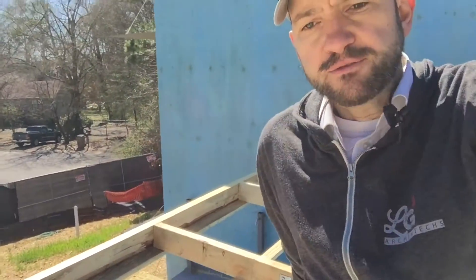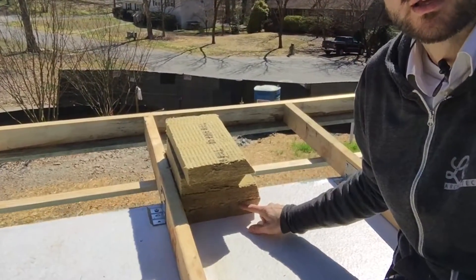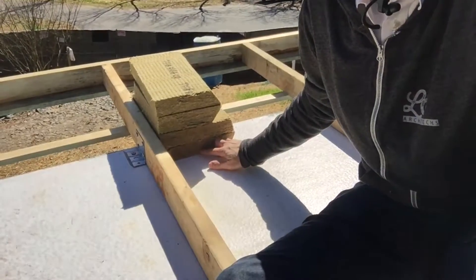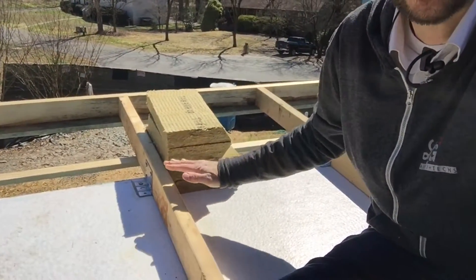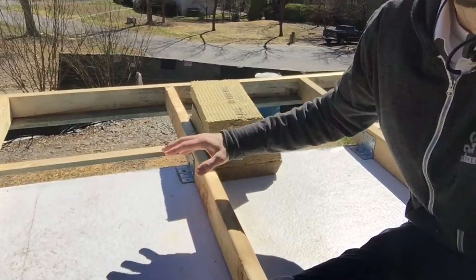This is representative of four layers of two-inch rock wool TopRock DD insulation — representing what we're going to put on this roof. We'll use two layers of three-and-a-half inch. That first layer will be flush with the top of these outriggers, and the second layer sits on top of that. Then we'll take a 1x4, set it on top at a 45-degree angle, and attach a nine-inch screw through the 1x4, through the insulation, and down into the top chord of the roof trusses inside the structure.